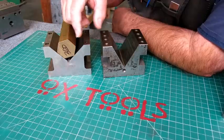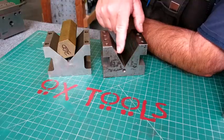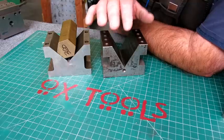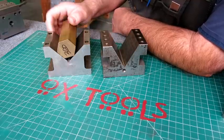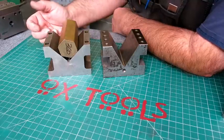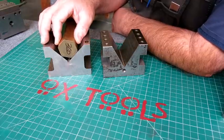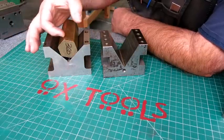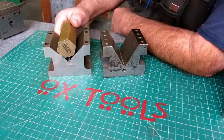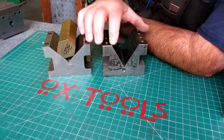I don't remember the exact correlation off the top of my head — there's a little formula for figuring it out. But the point is: if you're inspecting close limits and want to check roundness, roundness is actually pretty hard to check, but V-blocks can expose out-of-round conditions. You need a couple of different V angles to check for different lobing conditions because 90 degrees has some symmetry with a certain number of lobes. Two-point measurements like a micrometer don't necessarily expose lobe conditions of something that's out of round.